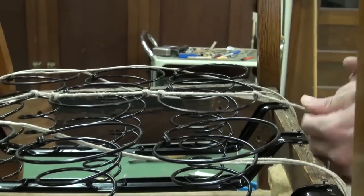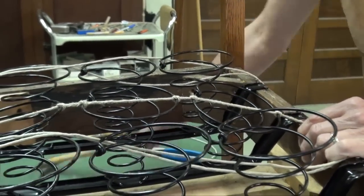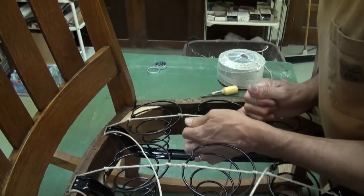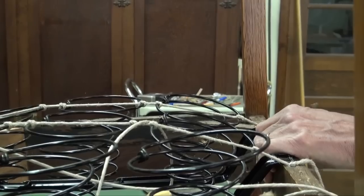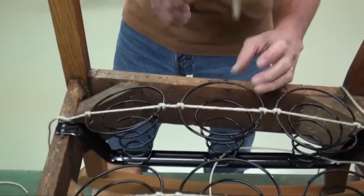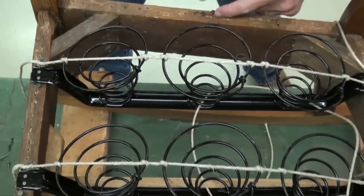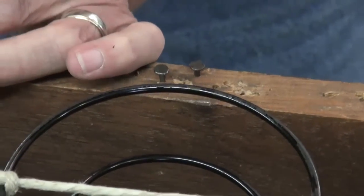With that metal strap in here, I'll pull these, stagger one side, I'll switch sides as I pull these down, make them opposite. I'll come back later and put some staples in there to kind of hold them in place. We're going to double them up again. As I'm putting these into the frame, I'm staggering the grain so that I don't run them right in line and cause just like a wedge that's going to split the wood. I stagger them just a little bit.